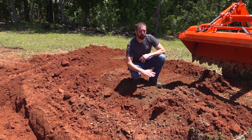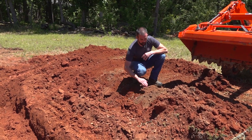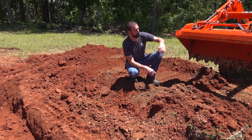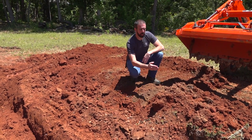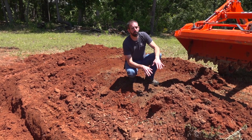We've got a bit of a mound here. As you can see where I'm at, I'm here and it drops down. This is hard dirt under me, but there's a pile of dirt on top of here that's in the way. So what I'm doing is I've got my bucket curled down. I dip my bucket over the hole, I lock it in the float function, and as I back up, it drags that bucket up over the hill, and that's going to pull all the loose soil off the top and leave the hard soil still intact.